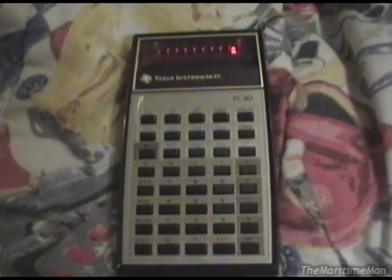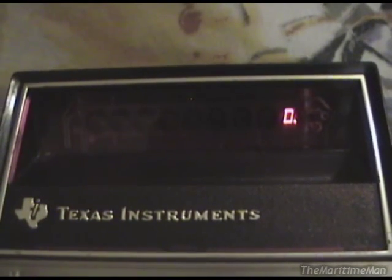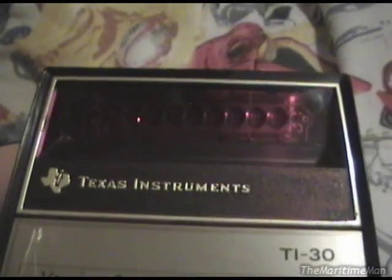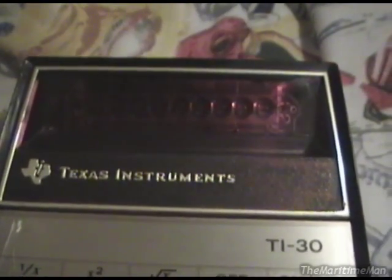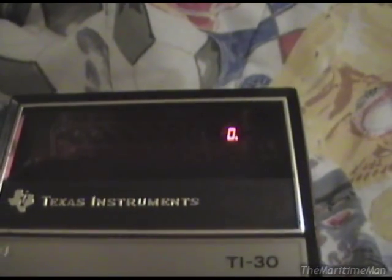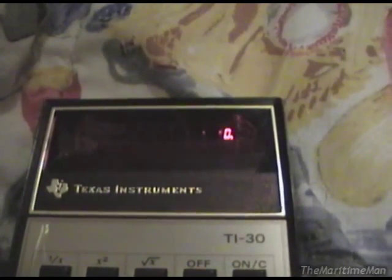Before I close out this video, I want to show one other feature. After 30 seconds or so, it kicks into this screensaver-like thing, and it'll do this for about 10 minutes and then just shut off — this is a battery-saving feature. I took my multimeter to the battery while it was running and while it was in screensaver mode. While it's running at zero, it uses about 15 milliamps of current, and while it's in screensaver mode it uses about 6 or 7 milliamps. So it does indeed save battery power, that scrolling dot. If you want to wake it up, just press EXC twice and it'll get you back to where you were — everything's saved in memory while it goes into that screensaver.